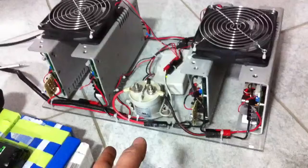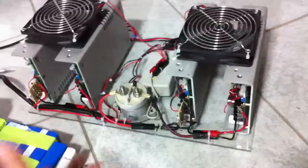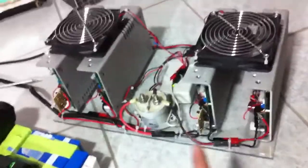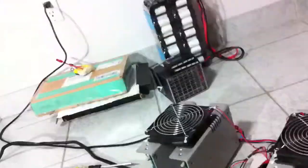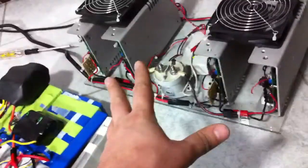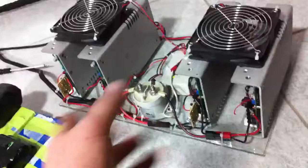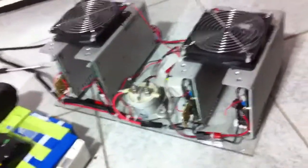When we start the charge, this will connect the power supplies in parallel with the pack to charge it. Then, when the charge is done and the timer shuts off, it shuts off the contactor, therefore disconnecting the power supplies and not drawing any energy back into the supplies, which would obviously pull it out of the pack. It works relatively well.